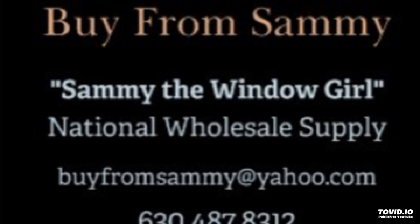If your only choice is to field mull, sometimes the project just calls for that kind of budget. People have to understand that when you're doing window replacement, you're booking a whole crew for the length of the installation. You have to run electricity, deal with building permits, and handle building materials. For do-it-yourselfers who want to install a combination window in their opening themselves, these are your choices, and I would highly recommend getting a factory mull. It saves time, has more accuracy, has a cleaner look, and is overall an easy win-win-win for everybody.